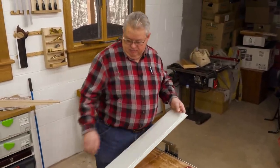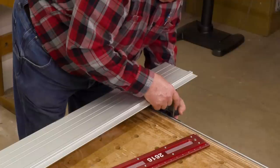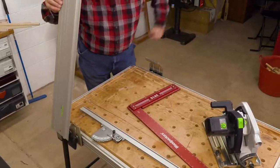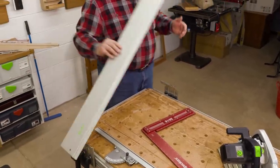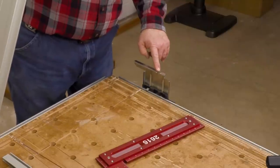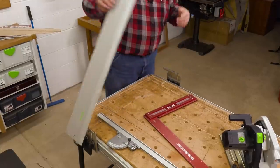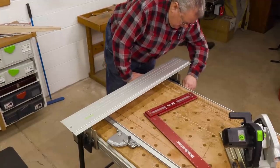We want to start out by getting the track straight across. I'm going to get way up high, almost to the top of the adjustment on the outfeed side, the operator side. You're running the saw this way — this is the operator side, this is the hinge side. I want that to just come across and that little nib right there that goes into the track, I want that to drop in without having to move it one way or the other. That is pretty good — it comes across and drops in just the way I want it. So we've got that part ready to lock.